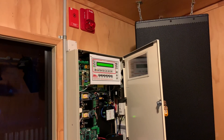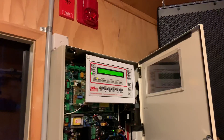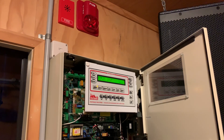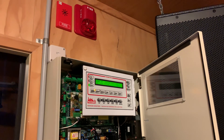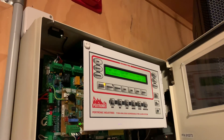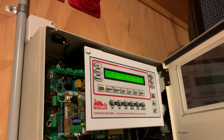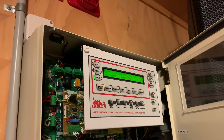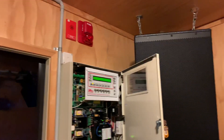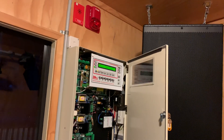All right, we'll just go to the next one. Not master bedroom because that's going to set the alarms off inside. Just go to device 20 — see what device 20 is. Let's do 10. Not that one, not that one — that one. That's going to set the alarms off straight away. So quickly test it, and once it's in fire turn silence off until you hear the siren, and then back on.